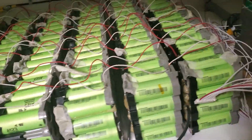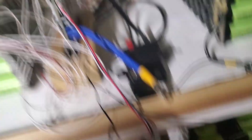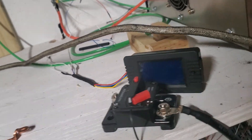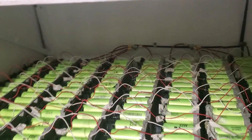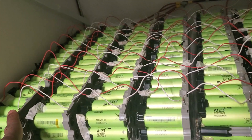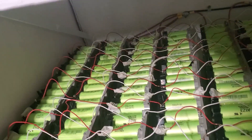There is no way whatever I'm doing here would draw 100 amps from one side of the pack. That's why I have a 100 amp breaker down there, and this one may be 200 amps because it belongs to the inverter. So there's no way I can come across 200 amps. I have 10 gauge wire and 22 gauge wire. I've tested before — if there's any bad connection, the wire will cut itself off, it will just burn and cut itself off.